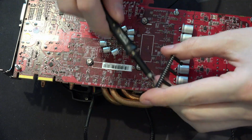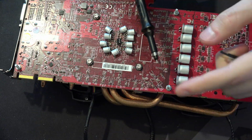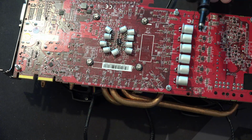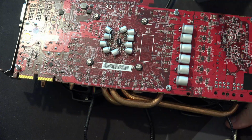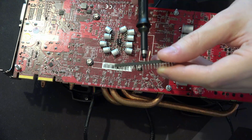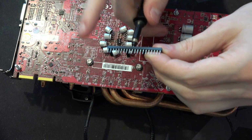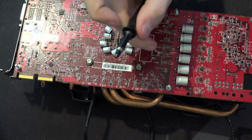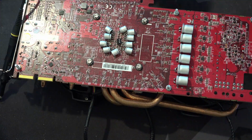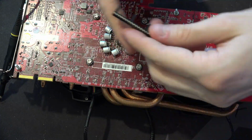And the nice thing is that this gives me a really short attachment length, because if you try to use alligator clips or anything like that, it just picks up random crap from the environment. So much of it. Like honestly, even if I just have that extension on the probe sitting like that, it already starts picking up random environmental noise, compared to if you don't have anything on the end of the probe. So any extra length is just no. But yeah, so I shortened it. Basically I cut one of these up, which actually this is the cut up one, right? That's what's left of it.